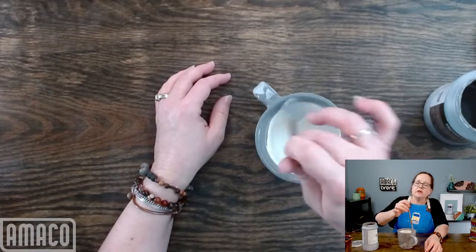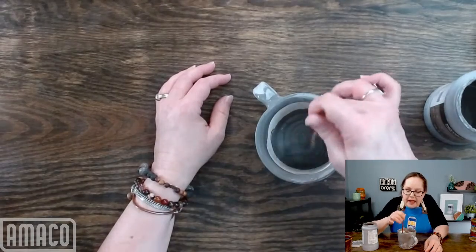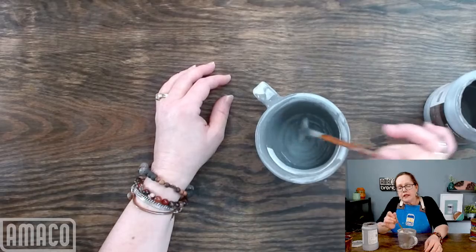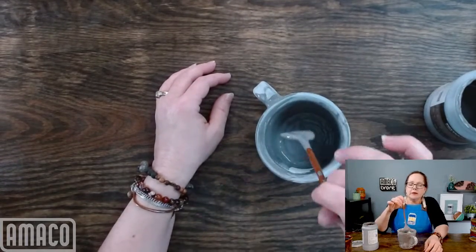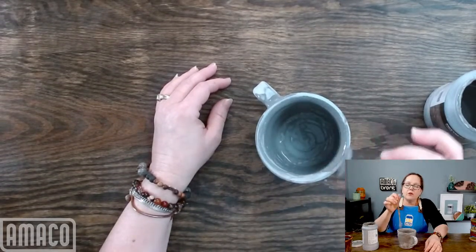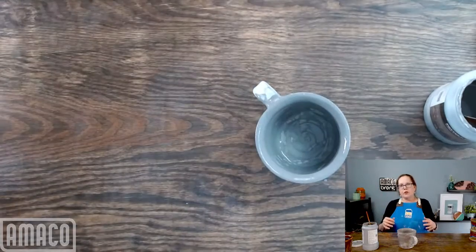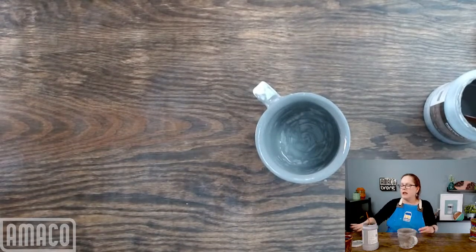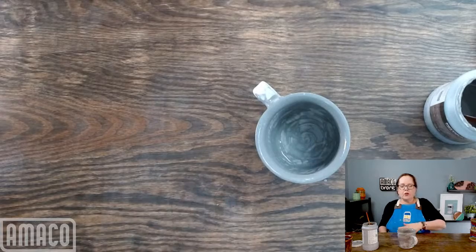It will fire just fine. If you are using the oatmeal as a base coat and it is cracking, you probably will have some crawling. So add gum solution and a small amount of water — as little as you can — to get it back to a usable consistency. I recommend using that as soon as possible, because otherwise it will thicken up again and you'll end up adding more and more water, making it materially thinner. So if it is cracking, use gum solution.